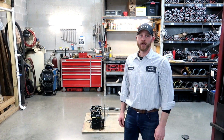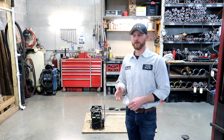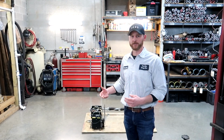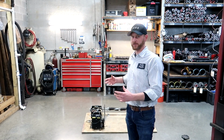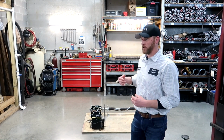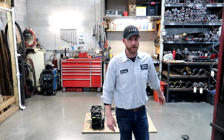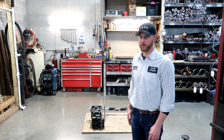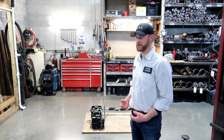Hey guys, one quick thing. I was just editing the video. I wanted to touch on a few things. Number one, if anybody's wondering, the popping noise that you hear when we're cranking the spring up: as the spring winds, it stretches, it expands. So the shaft moved a little bit and our sprockets weren't lined up. We only have one shaft collar on the one end here, and the whole rig, it's not really ideal. It was just something quick that we threw together. It's not the most rigid thing, but at any rate, so that was the popping.